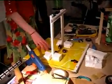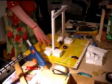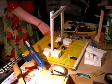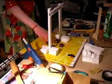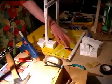Then the stator: four coils, 200 winds on each coil, and a little bit of wire in between them to connect it up. Glued down, all going in the same direction, with your two ends connected to your LED.